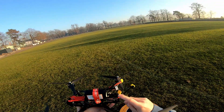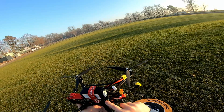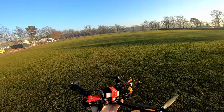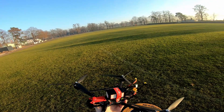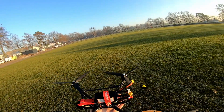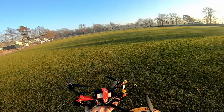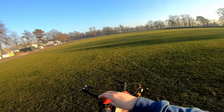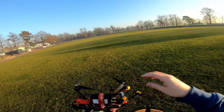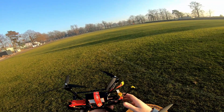We've assembled this drone. Right here we have the power pigtail and you can see I got the huge capacitor as close as possible, just to not cook the ESC. I heard two rumors about this frame and stack combo: first, the ESC was prone to break on these huge motors and could easily smoke; second, the frame had some low-throttle oscillations. We'll test both on this video. I also put a small TPU antenna holder and in the future maybe we could fly with a GoPro. We'll fire it up on 6S — this setup is literally all AliExpress, every part from one order, so you can get it stupidly cheap.